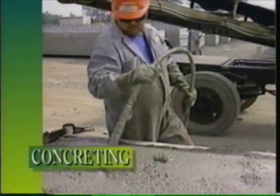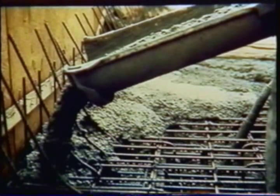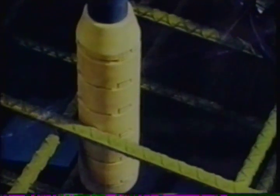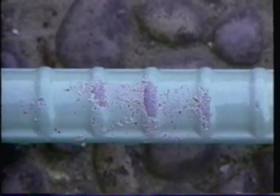When pouring the concrete, take caution when walking on the rebar not to drop anything such as hand tools or construction materials on the placed bars. Set up runways for concrete buggies and pumping hoses and properly support them. Maneuver carefully to minimize damage to the coating and to prevent shifting of placed bars. When vibrating concrete, use a non-metallic or rubber vibrating head to minimize damage on placed epoxy-coated rebar. Metal heads can cause damage to the coated bars within the concrete.